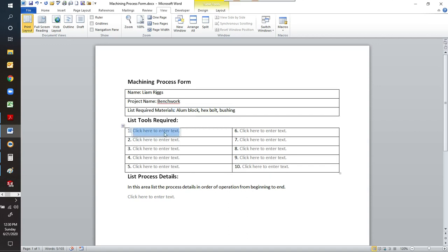Okay, so step one, we're going to lay this out. If you've watched the video on this, you know that you're going to lay it out using Dykem. You're going to need a hammer, and you're going to need a center punch. So down here, process one. You're going to lay out and center punch all your hole locations.